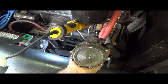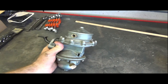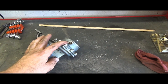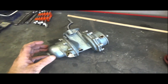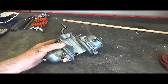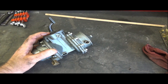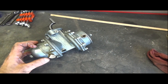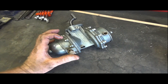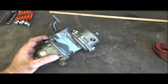Now we can see the whole pump in better light, and I'm going through the manual. It's very specific: you should remove the top vacuum diaphragm and disassemble that first before disassembling the lower fuel diaphragm. Another point the manual makes is that you should remove the rocker arm mechanism before trying to assemble the main plunge rod going up and down — you can't tilt that rod or you might damage one of your seals.